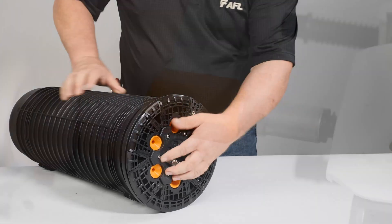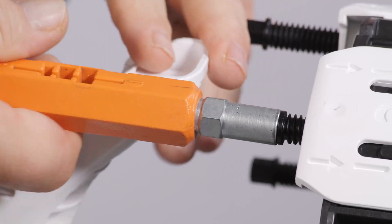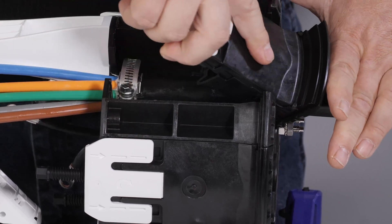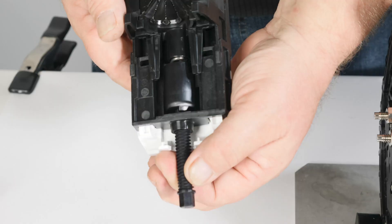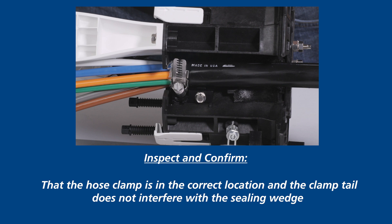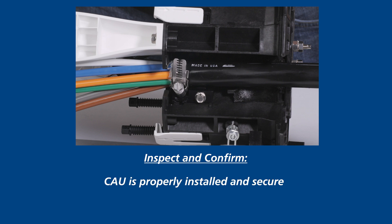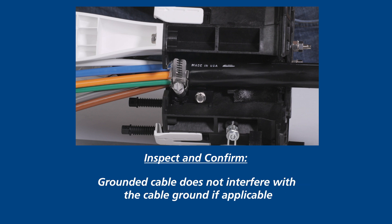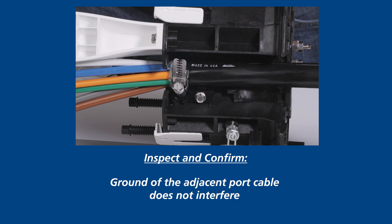Install the closure into a stand if available. Completely loosen the gel compression screw — the sealing wedge will stop the screw once it reaches its full relaxed position. If it has not properly engaged, remove the sealing wedge and store it in a safe, clean place. Completely release the gel compression screw. If the gel compression screw unthreads from the sealing wedge, simply reinsert the screw and thread it back into place prior to unlatching the sealing wedge. Inspect and confirm that the hose clamp is in the correct location and the clamp tail does not interfere with the sealing wedge, that the cable attachment unit is properly installed and secure, that the cable is in place to be secured by gel and is not out of the gel cable channel, that a grounded cable does not interfere with the cable ground if applicable, and that the ground of the adjacent port cable does not interfere. Repeat assembly and retest.